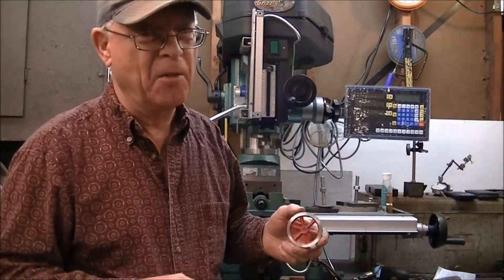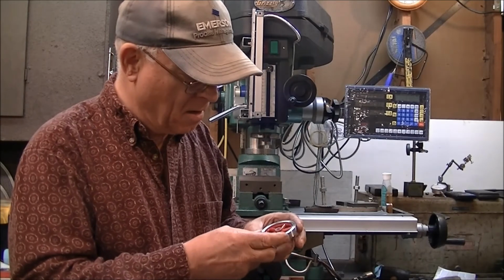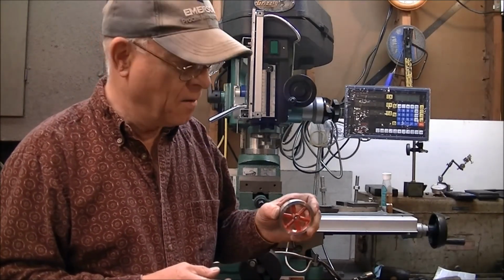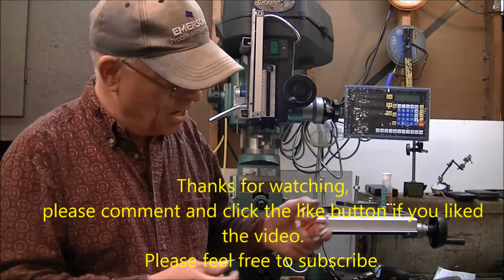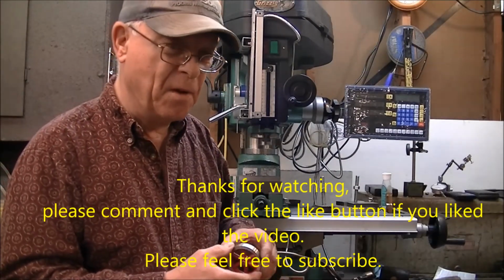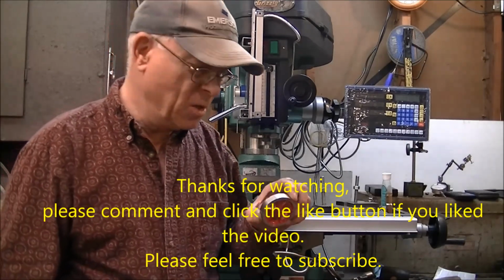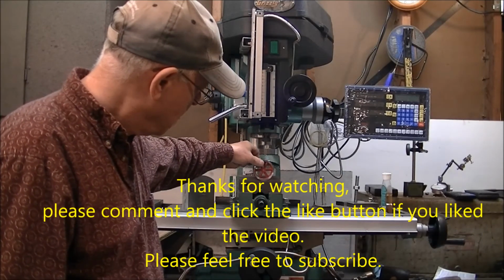All the cutting I did on that was run the tool in 2/1000ths of an inch, and I never got in any hurry because I figured I would mess the whole thing up right at the last minute if I got greedy and started making big cuts. So at least I succeeded in making a flywheel, and I learned what to do next for the next batch of flywheels, and I learned, in general, better practices than what I did this time.